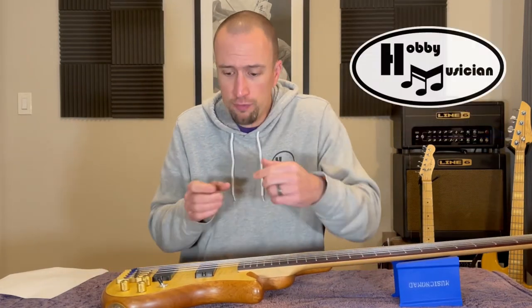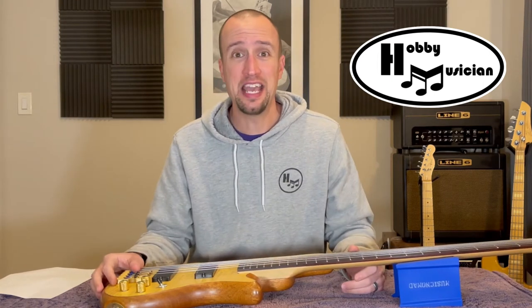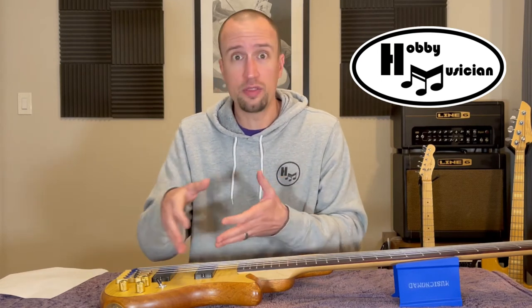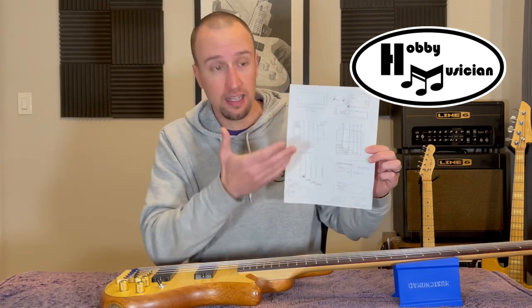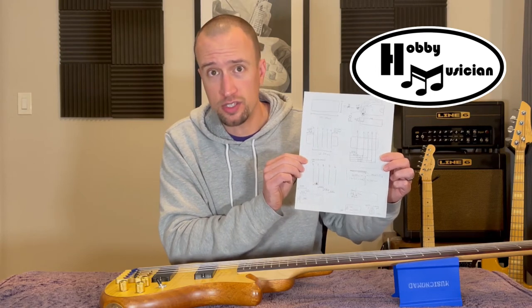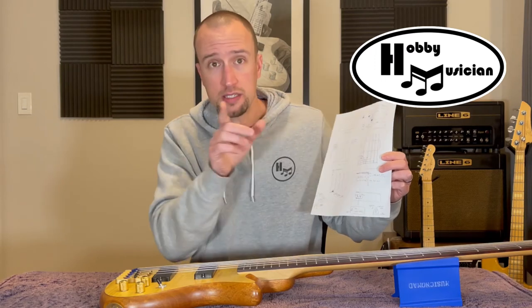Not just the length and width — I also needed to measure how far in the little indents go with the screws, how far apart the centers of the screw holes were, and how far down these indents went. In addition, I went to the manufacturer's websites to gather even more dimensions than what I could physically measure, so I had a complete picture. That let me create a cheat sheet of all the specific dimensions going into our eventual design.